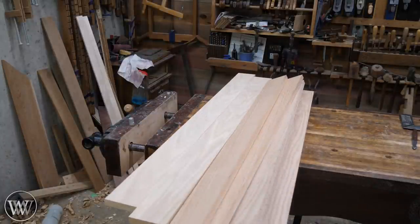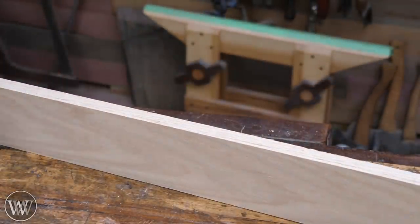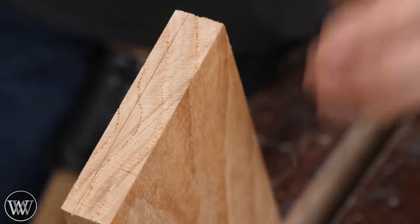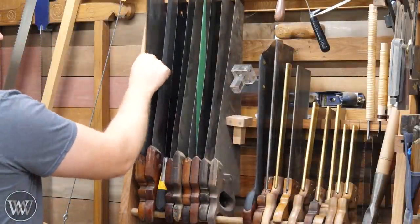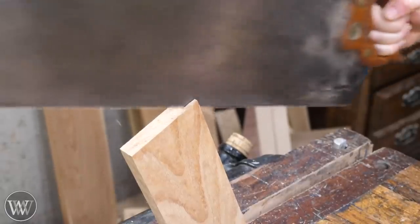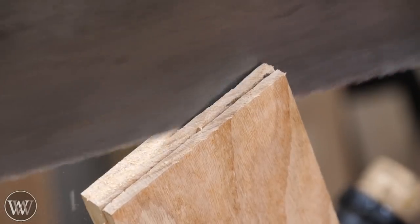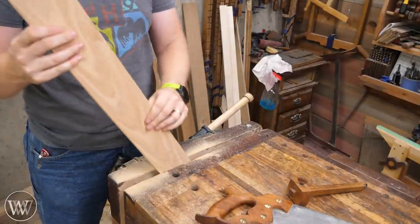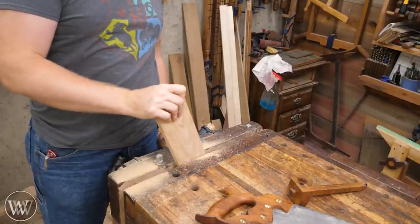A new project and we have some oak. These are oak boards that are three-quarter inch by about three and a half inches. We need to re-saw them down into three equal pieces because we're going to be doing some laminate bending. I'm going to mark a little bit less than a quarter inch on either side, and then put the saw running on the inside of either of the lines, so we'll be cutting both strips at one time. I started with a handsaw but this one ended up being just a little bit too wide, so I put the handsaw down and grabbed the frame saw.